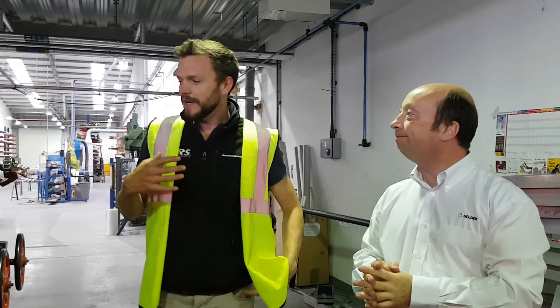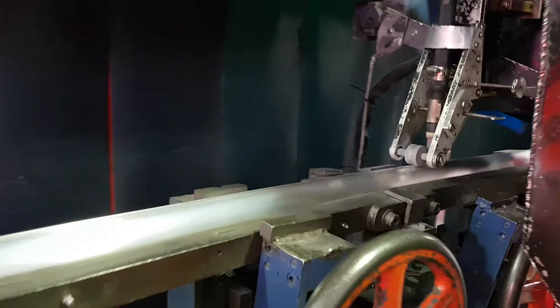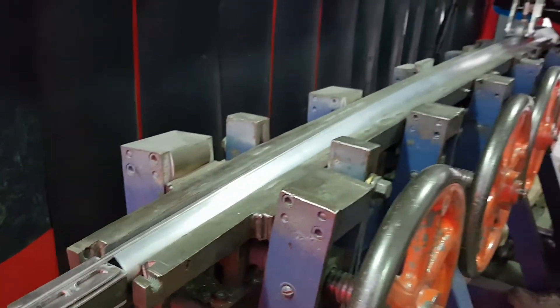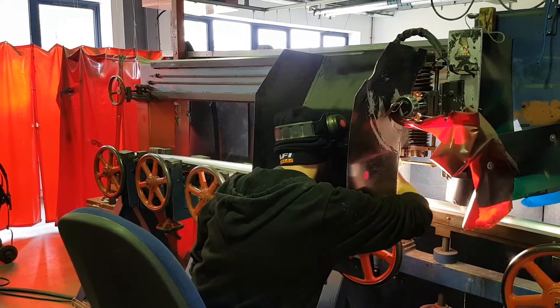Now we're at the welding process, where we make it back into a tube again. The tube gets clamped up so that the weld is nicely joined together, and then a welding head moves along and welds the V back up again. The machine is semi-automated. One of the things which is really important is that we weld the tube when it's perfectly straight, so the machine is laser aligned to make sure the mast is absolutely dead straight and the weld is dead straight. We've now got a tapered tube, but we still haven't got a heat-treated tube, so now we need to bring that material up to full specification.